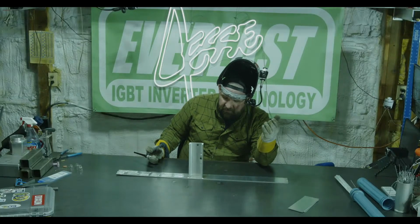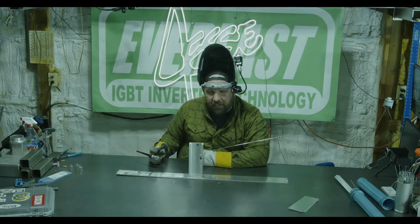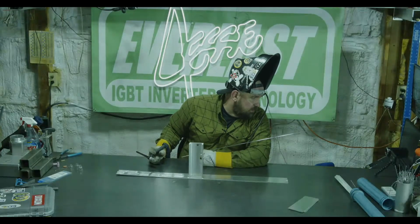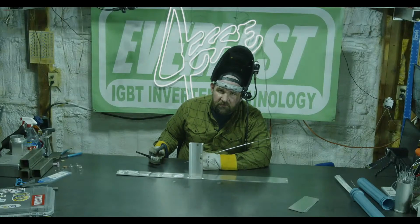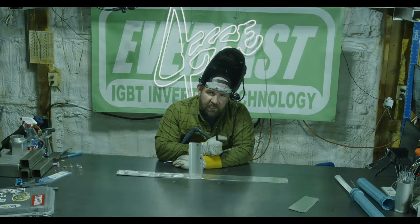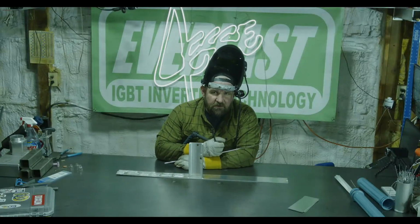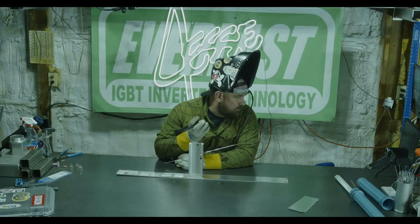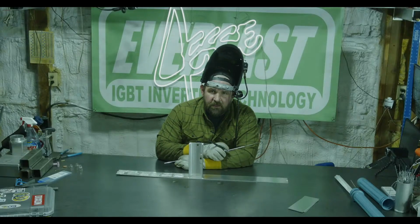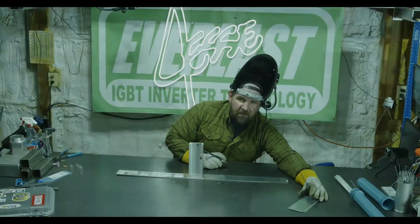I did a lot of testing with even different cup sizes. We did different gases, different tungsten, and I stayed on 1/8 inch tungsten. So even now, for aluminum, I pretty much only run 1/8 inch tungsten. Actually, that little run I did earlier with the standard cup running 3/32 tungsten was the first time I ran 3/32 tungsten on aluminum in probably the better half of a decade.